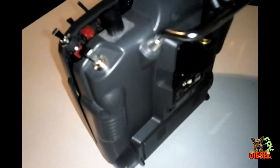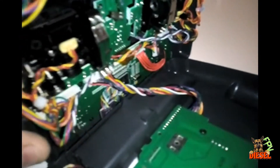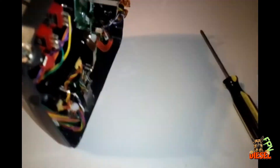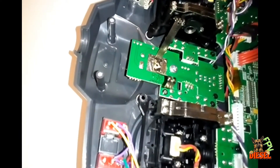After taking out the six screws on the back of the remote, you want to just lay the transmitter open and unplug the main cable going from the back of the transmitter to the front. Once that's unplugged, you can just take the back of the transmitter away — we will not be using that.